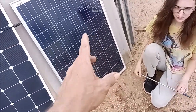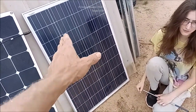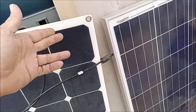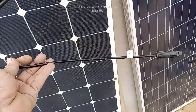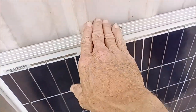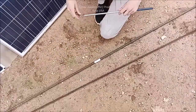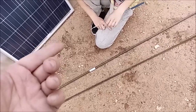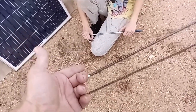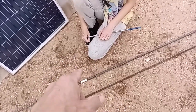That's why you see what we showed you in the beginning of the video — the ground is the third part in their circuit. This solar panel is not part of a ground of any kind. This is an aluminum frame, but it's on a DC direct current device, a solar panel. She's looking over a pair of ground rods. A ground rod is used because you need to create a circuit. That ground rod gives you the circuit you need. The utility company doesn't give you the circuit — that ground rod does. They give you two phases, you split it with a ground, and the common coming off their transformer is not possible without the ground.